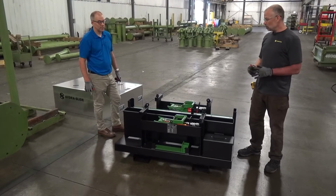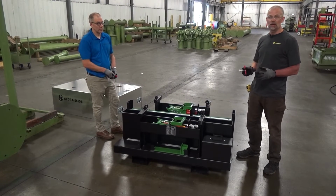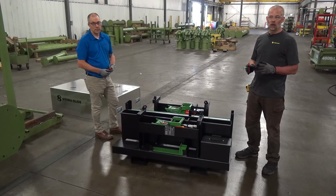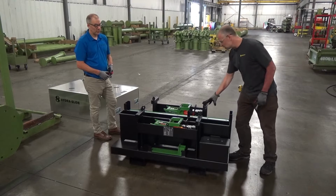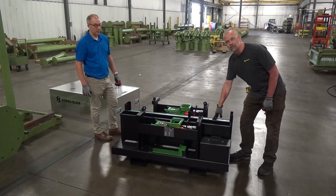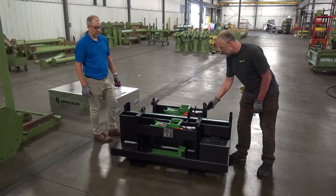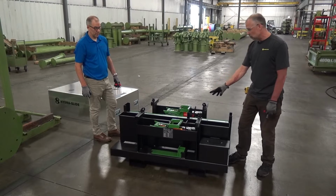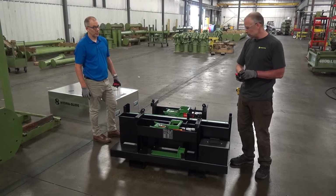So I'll tell you a little bit about hydraulic skidding. Hydraulic skidding is the operation of sliding a load horizontally at ground level along a guided path. The guided path with this system are your track sections, and they are steel tracks with a UHMW high density polyethylene plastic surface, and the slider pads are what the load sits on, that sits on the track, and have a stainless steel polished bottom surface.